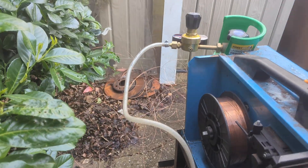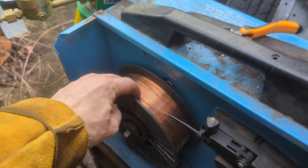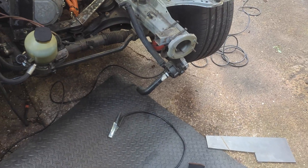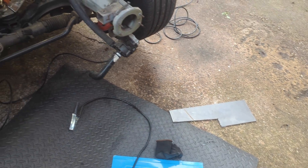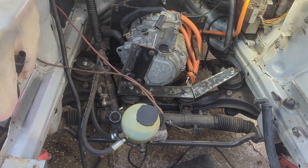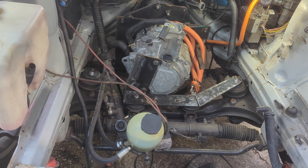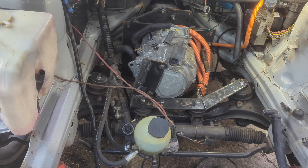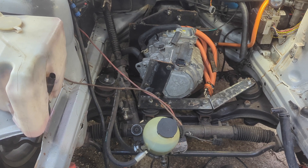I've just had to bin a load of welding wire because it was rusty. This stuff is still not perfect but it's getting better as I go down through the layers. I'll do a few beads on that piece over there — I've not cleaned that piece up. It's one thing getting a welder out at this time of the morning; it's quite another thing getting an angle grinder out. So I'll just do some very messy runs on there just to get a sense of it, and then I've got everything lined up in here ready to go — it's all bolted down. None of the clamps I've got are really going to work for holding it in place, so it's going to be a hold-and-MIG kind of affair, just tacking it in place, adding some more beads and trying not to get too much heat into it as it melts the rubbers. I'll probably get a wet cloth on there as well — not on the welds, but just around them to keep it cool.